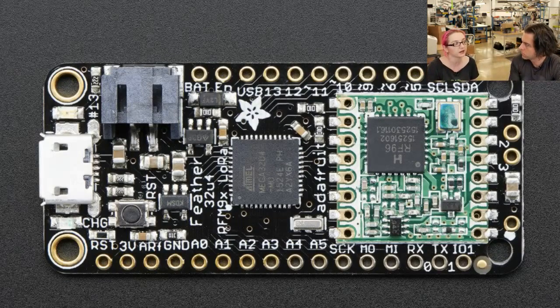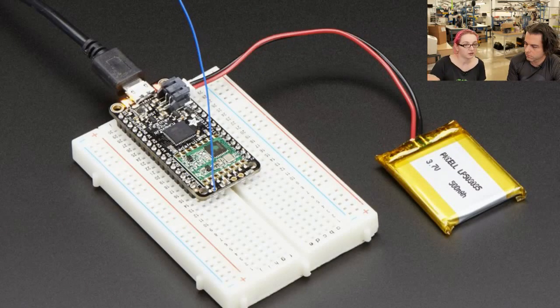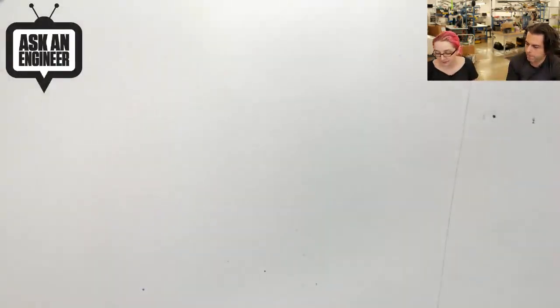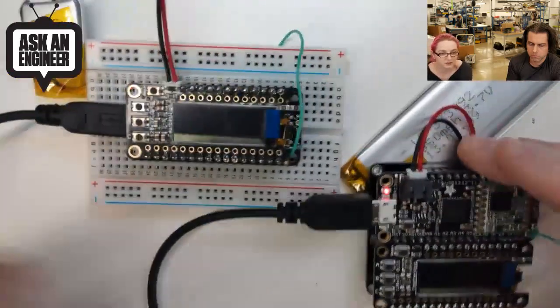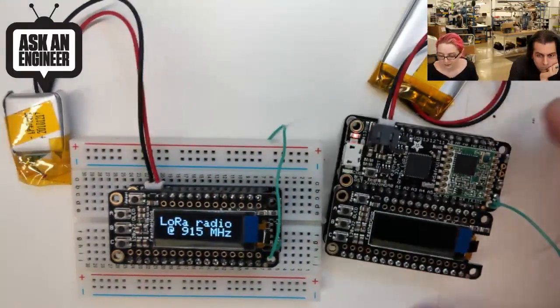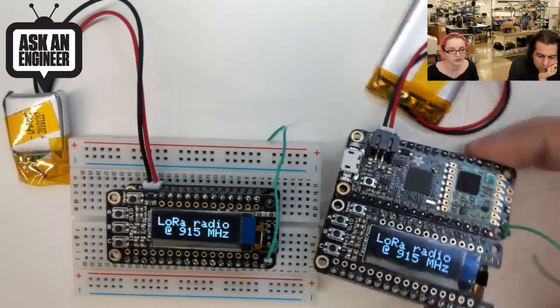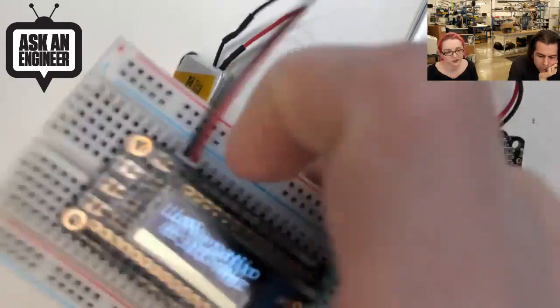We have the normal RFM 900 MHz and 433 radios and then the LoRa version — you can't use them to talk to each other, but you can get one of each or decide which ones you want. So for the demo: I'm using that Y-cable to charge both of these, but they're charged so I can unplug them. Both of them have a LoRa radio. This is the Feather with an OLED, and this one has the Feather with the OLED on top and the radio underneath. I have cute little wire antennas, and you can add a UFL connector for a larger antenna.